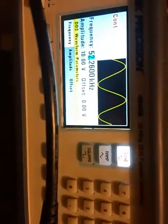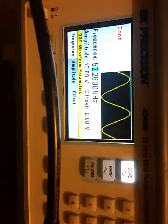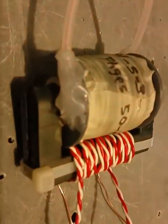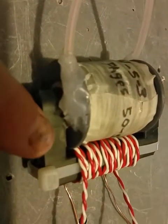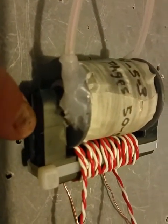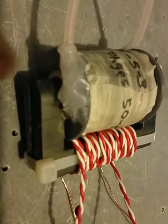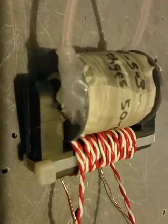The amazing thing is it's being powered by a function generator at 10 volts — this thing puts out a couple watts, not very much. 52.26 kilohertz running a sine wave. We built this in the lab; it's got 700 turns of number 30 wire. We took a flyback core from a television and it's made out of PVC, wrapped with 700 turns.